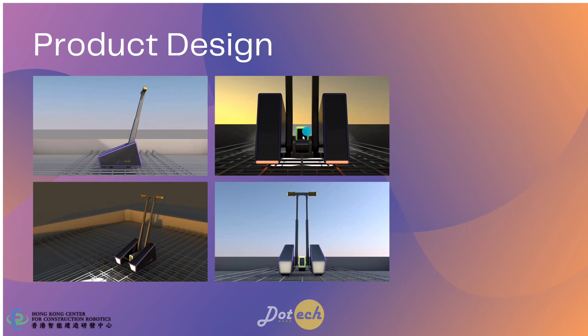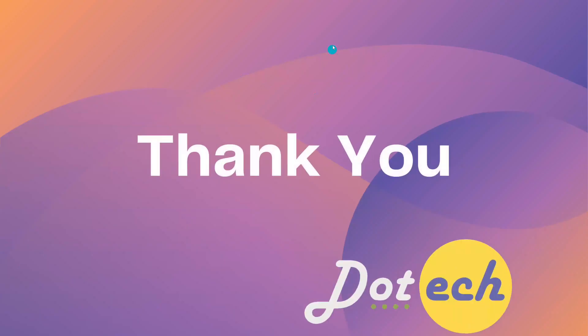This is a TOF sensor — an infrared sensor applied to detect the location of the rebar intersections. The spacing of the two tying units can be adjusted to fit different rebar spacings. The tying units work automatically as the machine moves along the reinforcement. You don't need to stop; the tiers will conduct every tying operation automatically.